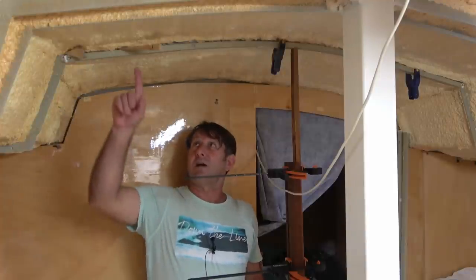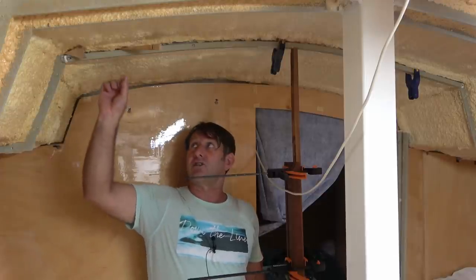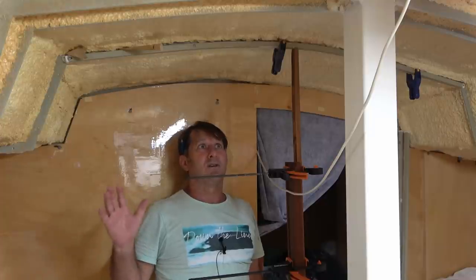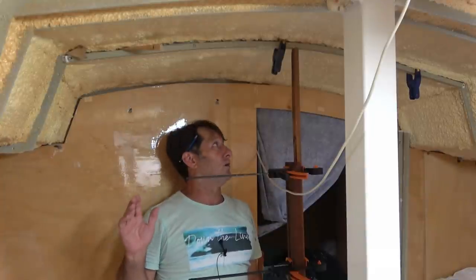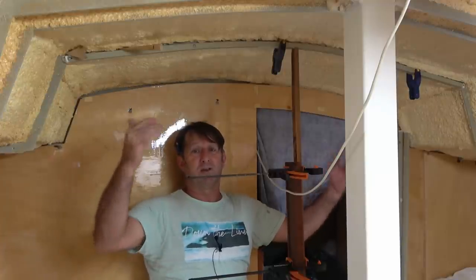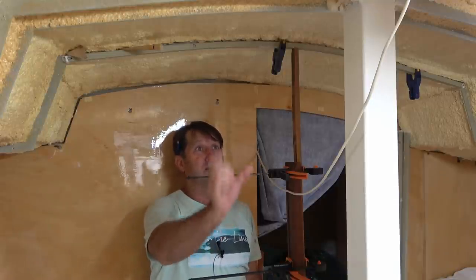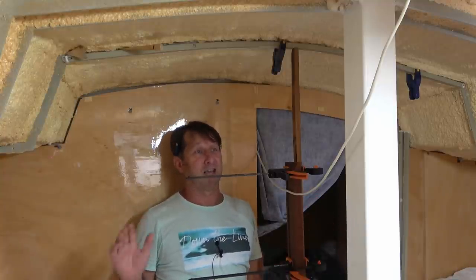And as you can see, for example, I've got a couple of little wedges in here just to get that batten just shy of the beams so that that lining will be sitting on the timber and not the beams themselves. So like everything, you live and learn, as they say, but it's coming up well. I'm pretty damn happy with it. And now that I've got to this stage, once I get those other couple done, I can get the first piece of Western Red Cedar in down that center line. I just think that's going to be such a game changer. I can't wait.